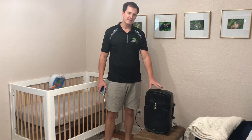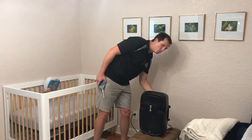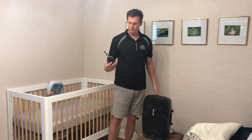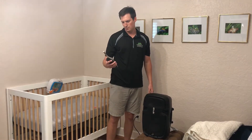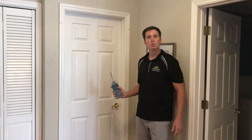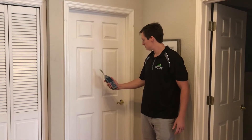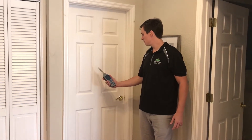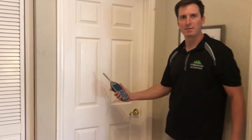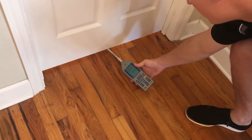To measure the effectiveness of the soundproofing, we'll demonstrate by using an ASTM test where we measure how much sound passes through the door. We do this by playing a white noise source at approximately 78 dBA. With the white noise source playing, we can see how much comes through the door — in the middle of the door, 59 dBA, and at the base, 65 dBA.